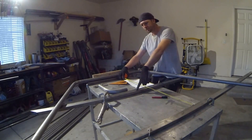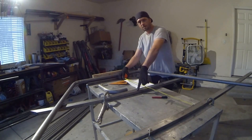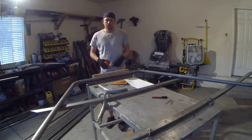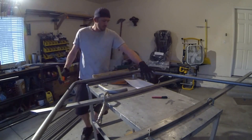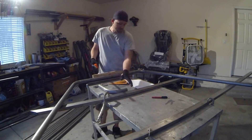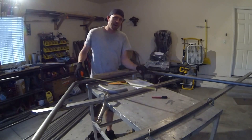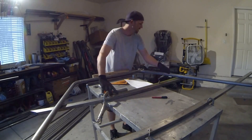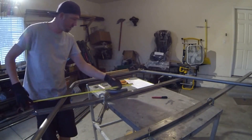I've also marked out the halfway point — the center line — which is in reference to the top here. The center line is also on the bend line, or at least the bend reference. To find out where everything needs to sit, we take half of 55 inches, which is our datum width. Half of 55 inches is 27 and a half. We're subtracting that half inch for tolerance and measuring outward 27 inches — so 27 inches on each side from our center line. Both of these have already been measured out.